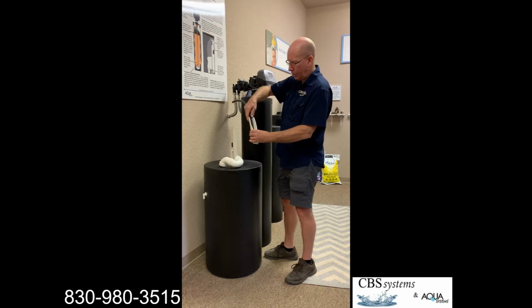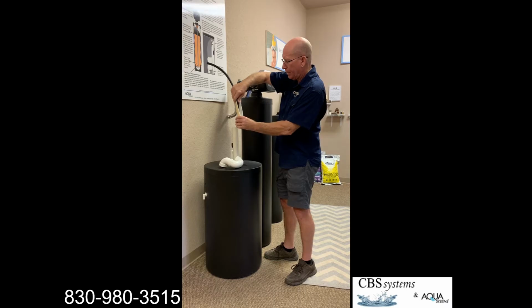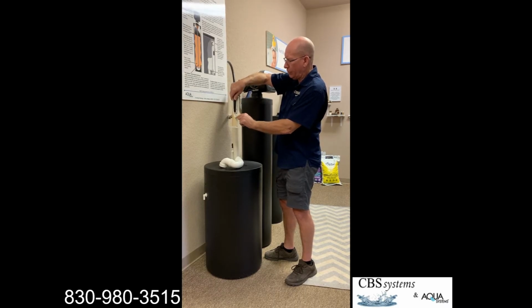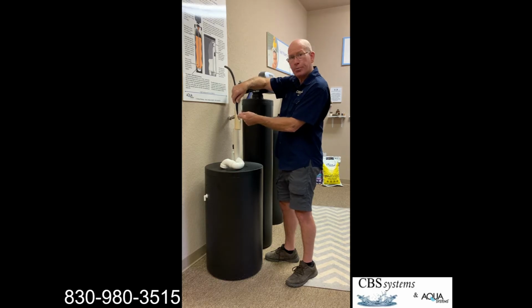This is an old style one where the drain line would get hooked to there, to what's in the wall, and you need a physical 1-inch gap between where the water could come out, to where the drain line is. And so if the sewer ever backs up, water would fall out and go on the floor, never jump uphill and cross-contaminate your drinking water. So it's called a physical air gap.